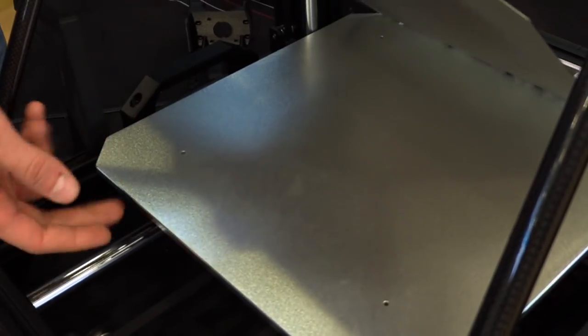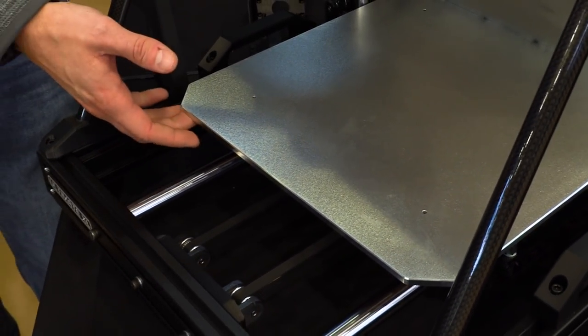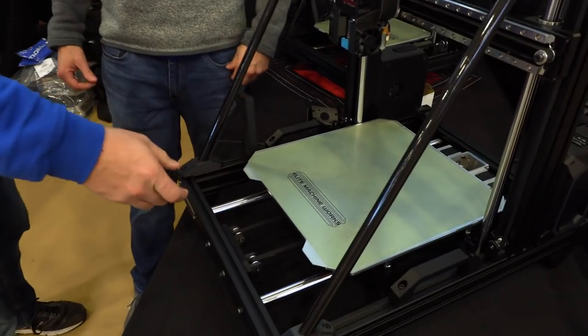The kits will come with the E3D V6. And that's probably the strongest magnetic bed on the market. I embed all the magnets into the bed — I machine the pockets — so the magnets are only half a millimeter from the surface of the bed. Then I fill those pockets with thermally conductive epoxy and machine down the overflow after the epoxy has dried. So the bottom of the bed is all nice and smooth and the magnets are permanent into the bed. There are 30 magnets in the bed. You buy those other systems and they kind of peel up the sheets — you won't have a problem with this. It's stout.